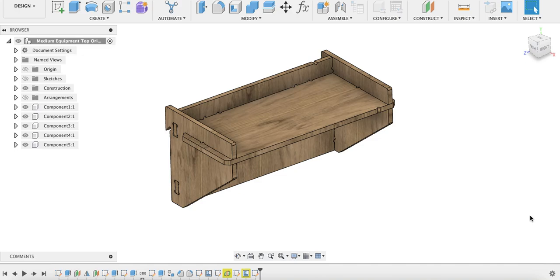So as such, before we start, you'll definitely want to make sure that your CNC machine is square. Your machine positioning is calibrated and known. Your wasteboard surface is not badly worn. Belts, if you have any, and V-wheels are tightened to proper specs, and that the tool you're using is worn from between good to excellent. There are some really good videos on YouTube on how to calibrate positioning and squaring your machine. In case you haven't checked them out, you should.